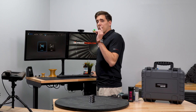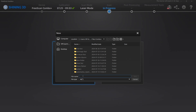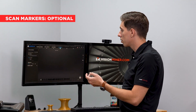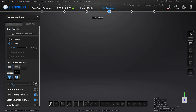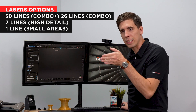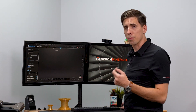Let's go ahead and open up the software here. I'm going to go into laser mode to start. We're going to select new project group, make sure you're in the right folder, and name the project '123 surfaces.' That's going to create the folder and everything else. Now I could scan markers — that's an option — most of the time I don't need to. So I go straight to scan mesh. And then I have three options for lasers: 50 lines on the Combo Plus, 26 on the regular Combo, or 7 lines for high detail, or single line for down-hole and getting into little areas. So we're just going to stick to the 50 laser lines for right now to get that speed and coverage.